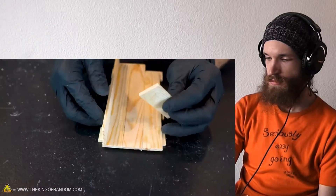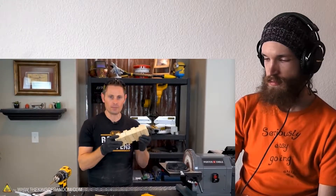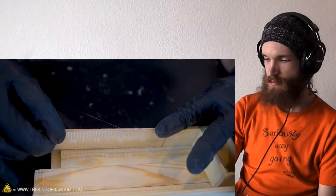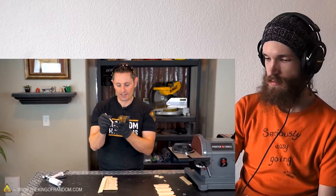It's a good idea to use another paint stick as a square — you can set that in and use it to help level the compartment. The pieces need to be as tight to the dowel as they can be because we're going to glue these together. While everything's locked up nice and tight, the wooden straps are assembled and looking really good. On the other side if it's a little bit longer, just use your belt sander or some sandpaper to grind it down.